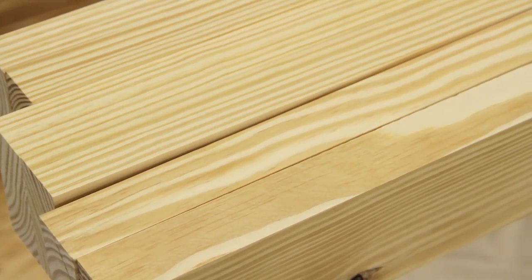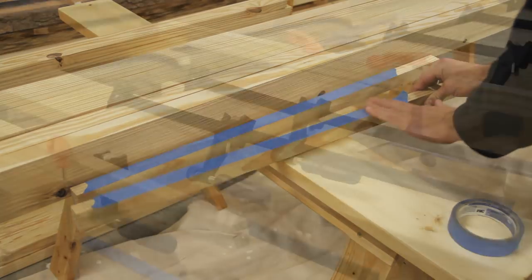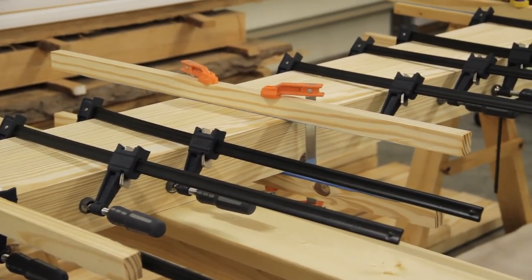After surfacing and cutting the boards they tend to warp slightly. To help correct some of this I made a few clamping cauls to go across the top and bottom edges of the boards during glue-up.